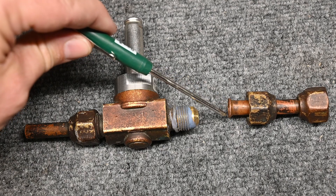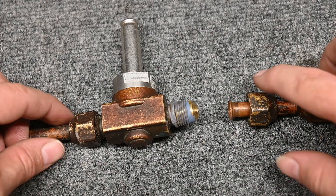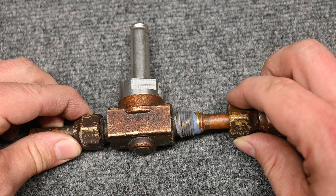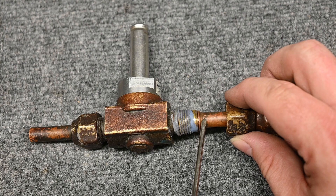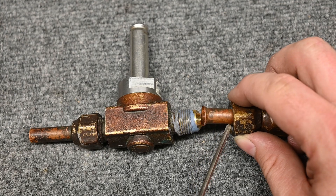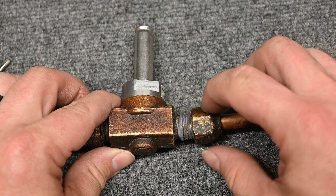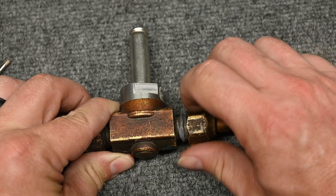This is a type of cone edge. We take this soft copper and we make this cone edge, which we call a flare. That flare fits up against another fitting, which is usually brass. It fits together like this. This fitting right here is what makes the seal. As the nut pulls it all together and we tighten it, it makes a good proper seal.